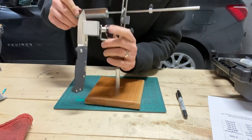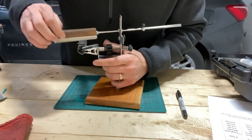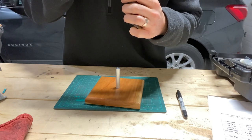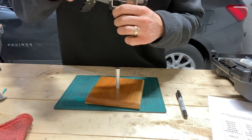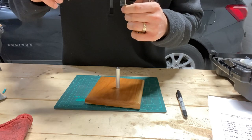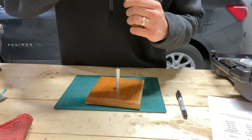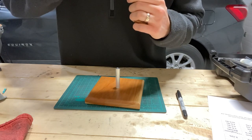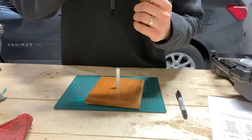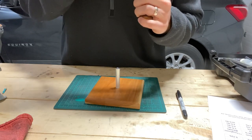Yeah, it's probably too big of a burr again. Just cutting off the burr, checking to see how that looks after doing that kind of a stroke. Kind of make sure I've done enough work on the 600, because it should flip very easily on the 600. And if it doesn't, you gotta keep doing your work. So this is kind of an important process. Looks pretty good.